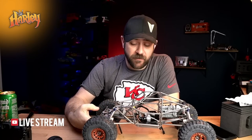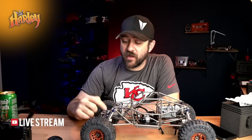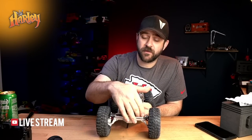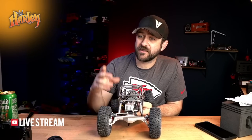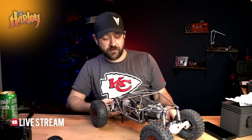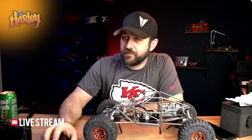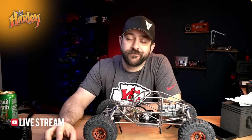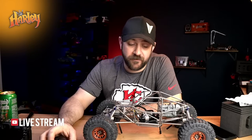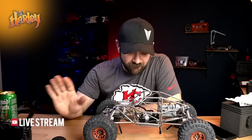But I still might change some things up on here as far as what I want to run. I may switch over to F10 portals rather than the F9 portals for the offset pumpkin, and I'll do a servo that mounts behind the axle down low. I want to keep with this width. I think that it keeps it in check, being the most reasonable for the scale. But I just need to get some of that done, which has not been a top priority. I've had this one around for a while, and I just work on it as I go.